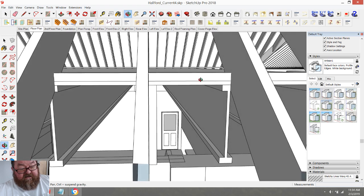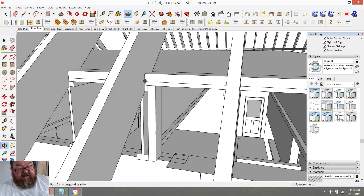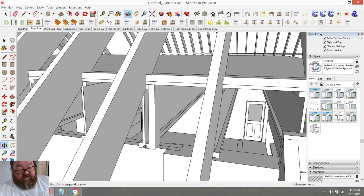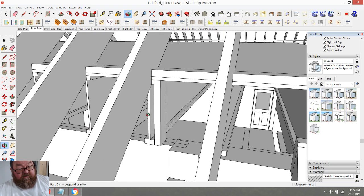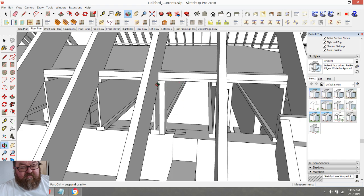You see? So what that does is it transfers the load of the rafter down to the wall like that. And really, technically this should line up with the rafter, but you can do it. They allow you to stack all the framing. Like now, the studs of this wall would be underneath. All your framing should be stacked. So your studs, your joist, and your rafters should all line up. And that keeps the areas between your studs non-load bearing at that point.